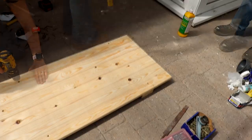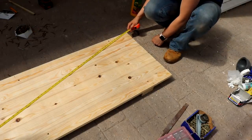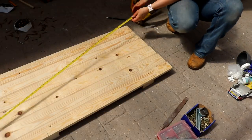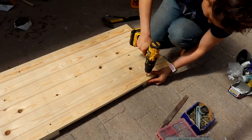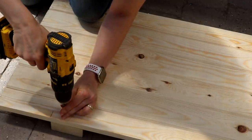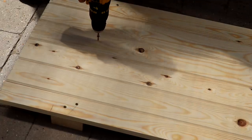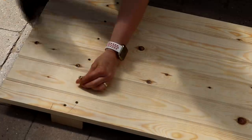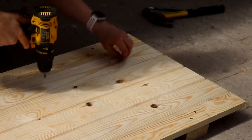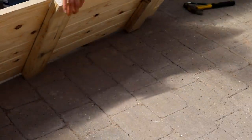Now these middle ones are trapped, I was able to tap them at the bottom to make sure they were straight. Before I screwed each slat, my dad's holding a tape measure in the opposite corner and we're checking diagonally to see if it's perfectly square. Often you'll find it slightly different, so I had to tap with a hammer and keep checking until both measurements were the same. Then I continued adding my second screws on either side, then one screw for each middle one along all of the spars — top, middle and bottom. Because I always add too much glue, I wiped the excess off with a rag.